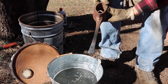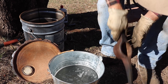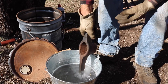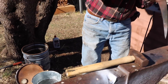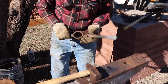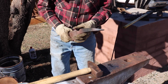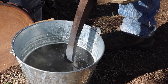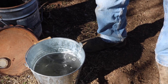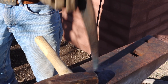Old duckbill here. I rake that in the dirt so I can see it better. The big dunk hardens the whole thing so that if it's hot up here it doesn't come down and take the temper away. You want it good and hard on the tip. Let's see what happens — see, it just barely made a mark on it.